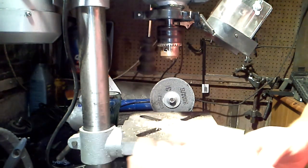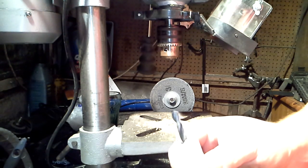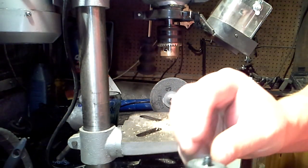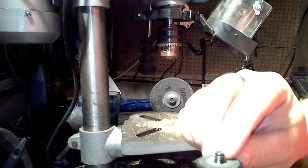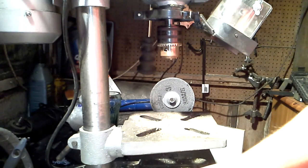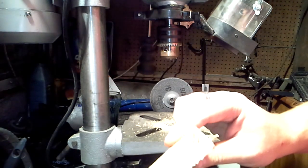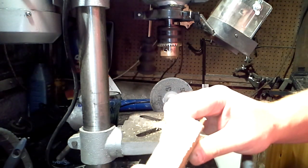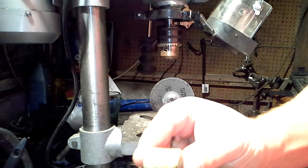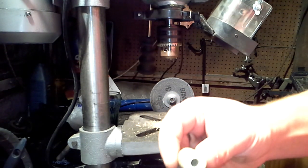So I'm going to take this 20mm hole saw with a 6mm drill bit, and the reason it's 6mm is this is essentially 6.2, 6.3mm across. So using the material that I have to hand, which I've got loads of at the moment, just some wood, essentially I'm going to drill through and cut out a centre part, which will give me this. So this is the one that I did earlier, typical Blue Peter style for those in the UK, and probably some of those abroad.